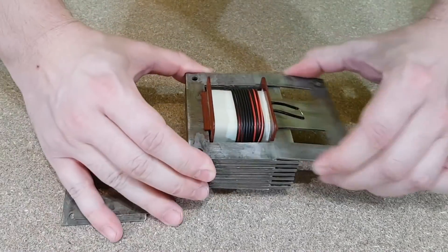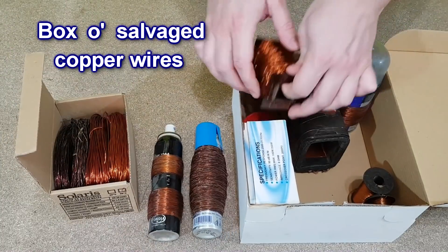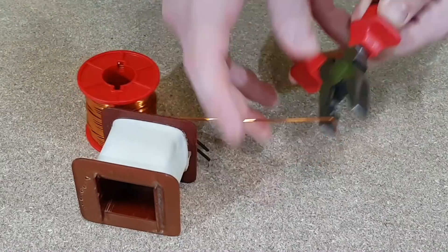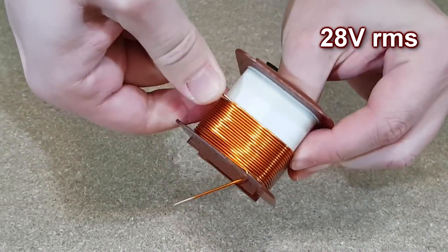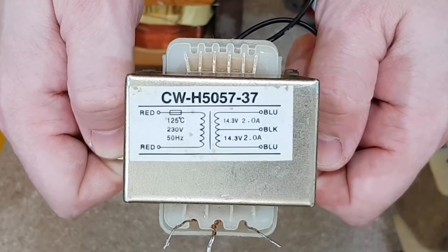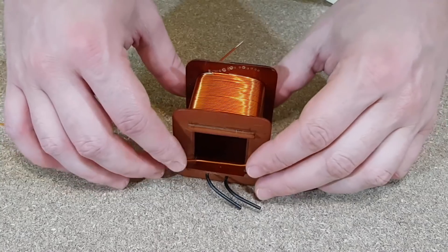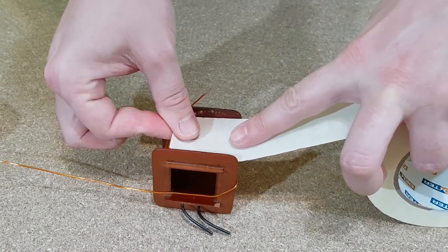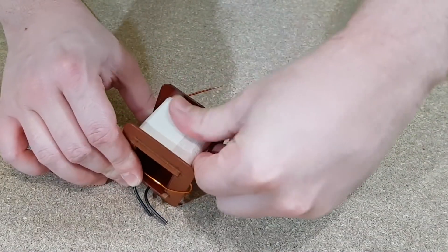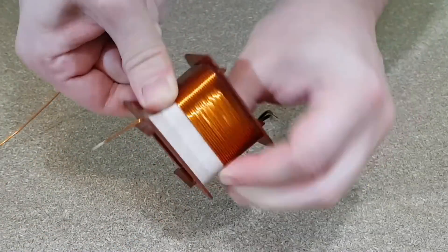Let's say you want a 38 volts DC transformer. We start by removing the iron sheets. We need some copper wire, so let's check out my box of salvaged copper wires. For this tutorial, I will use a wire with a diameter of 1 millimeter. I need to wind enough turns to make an output of 28 volts RMS — I'll explain in a minute why 28. I already have a transformer with a similar output voltage; if I join the two outputs, we have 28.6 volts RMS, but it has only 2 amps and I need at least 3 amps. So I will use this bigger transformer with a much thicker secondary wire. The 38 millimeter masking tape fits perfectly on my transformer bobbin, and I'll write the number of turns wound so far. Beside electrical insulation, the masking tape also makes it easier to see and arrange the next row of turns.